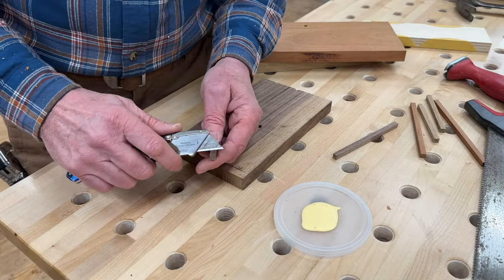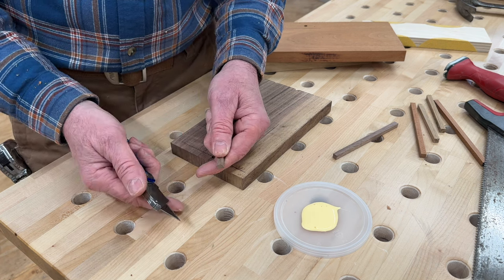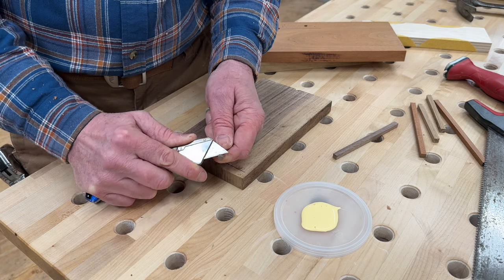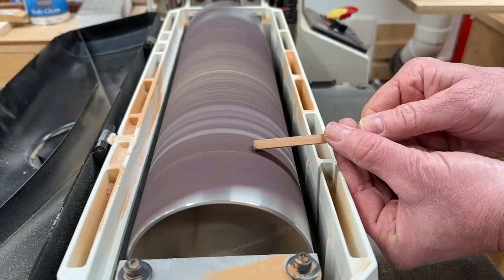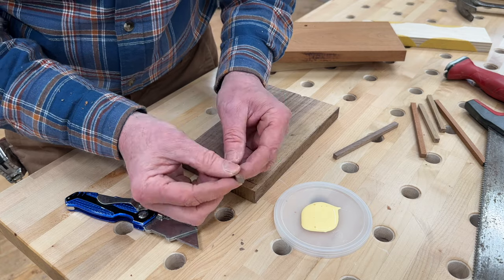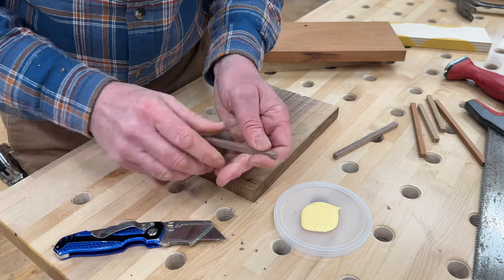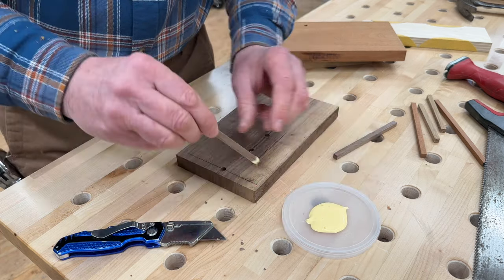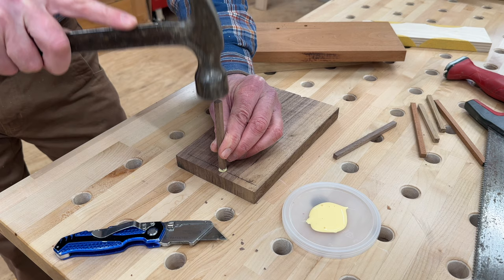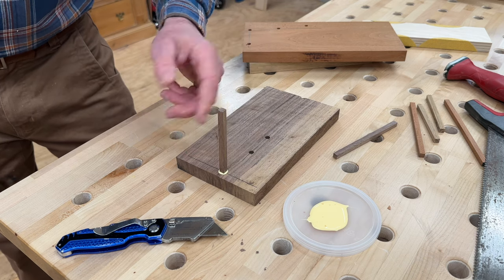Now you'll take the peg and you're going to whittle a little bit of a point onto it — not too much — and you don't want to go past about three-sixteenths of an inch, otherwise the peg would be rounded over near the surface of the wood. I'm using a utility knife here, but you can also use a drum sander — you can kind of set it up to do a few at a time — or you can use a belt sander turned upside down on your work table. That looks pretty good. Apply a little bit of glue, and you can hear that it is driven all the way home by the sound of the hammer.